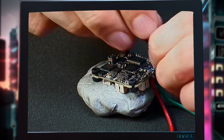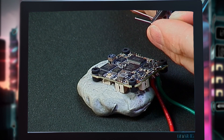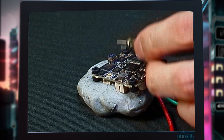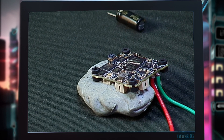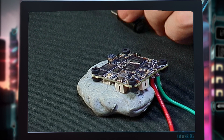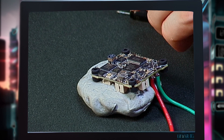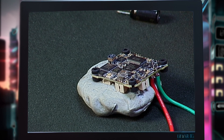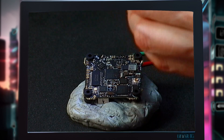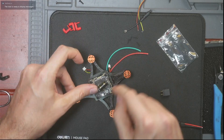One extra thing — and I feel like this is the secret to the sauce — I always add a 16V 470µF capacitor to help with filtering. That might be overkill, but my son has crashed his drone so many times and the board has never fried, never burned an ESC, never burned a motor. I really feel this capacitor is doing a lot to keep those fragile internals nice and healthy. You can leave the wires long until you're done.